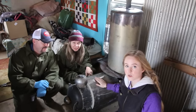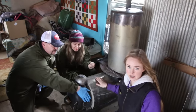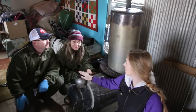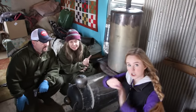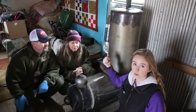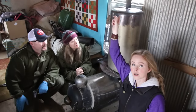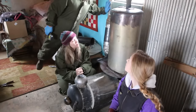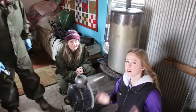The outside is cool, so if you have small children or toddlers around, you might want to attach it to the floor so that if it did get bumped it wouldn't cause problems. We do have a shield that goes around it and pea gravel that goes in so that this part also does not get hot. The hottest part is just right there on the top. Our heat flow fan is going right now to move the heat through the cabin — it's at 550 degrees.